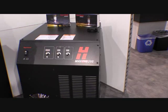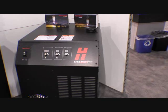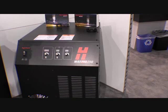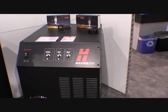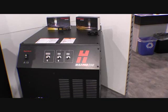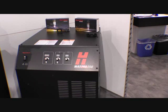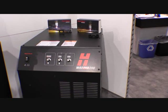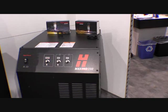A big change for customers that are interested in 200 amp plasma cutting is that we have applied our known long-life technology that we have for oxygen and air cutting. We've applied that to air-air cutting for the first time. So the consumable life is just incredible — it lasts a very long time, five times longer than the Max 200, the older system that this replaces.